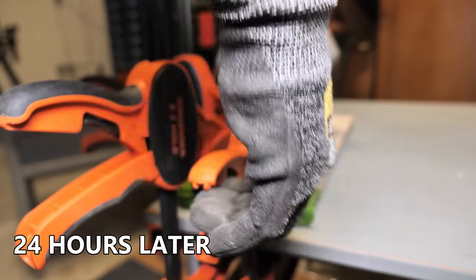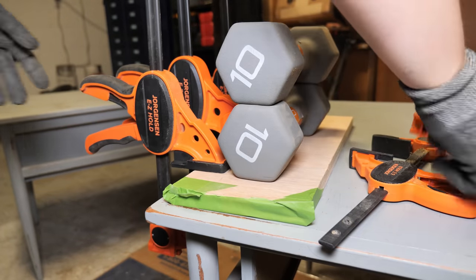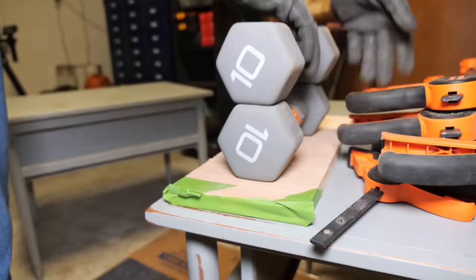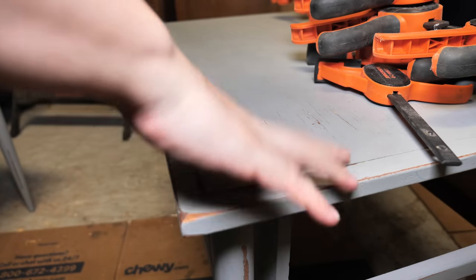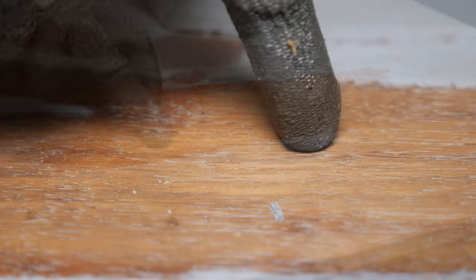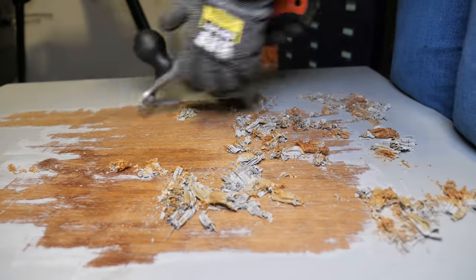After 24 hours, I removed the board from the top and was ready to begin paint removal. I started with the other side table that didn't have the bubbling up veneer, and used my scraper to figure out what had been done to the piece. It looks like they may have scuff sanded as the original finish was still present, and after scraping a large section, I realized the paint had gone into the wood grain, so I switched over to using paint stripper.